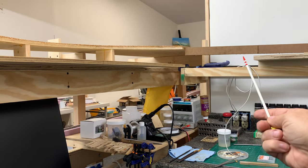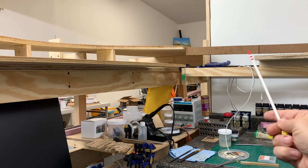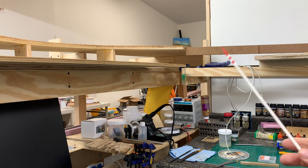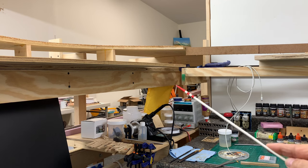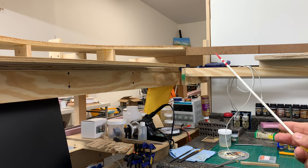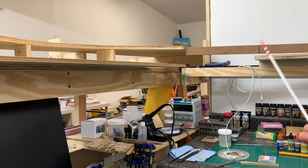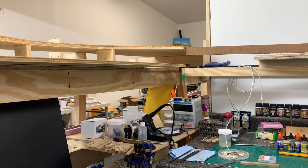And then I want a fourth separate line that is going to the spline for it, because that needs to be isolated for block detection. So it will have its own bus that then I can put one CT coil on, which then makes it detectable. And then I don't have to worry about putting multiple CT coils on where all the drops are on that, because there's going to be at least three or four feeder drops on that.